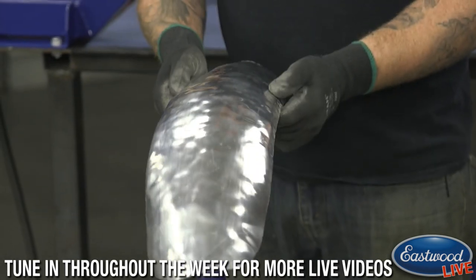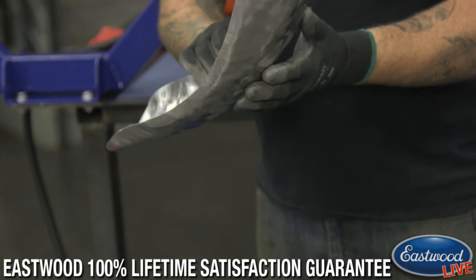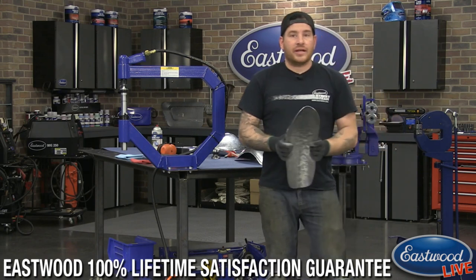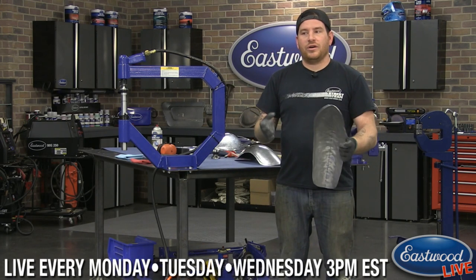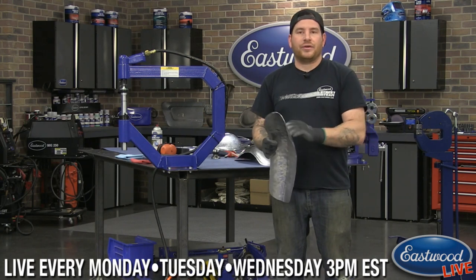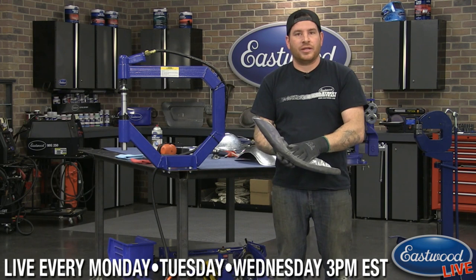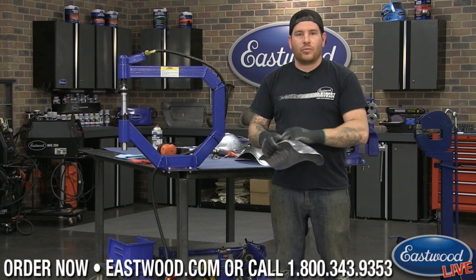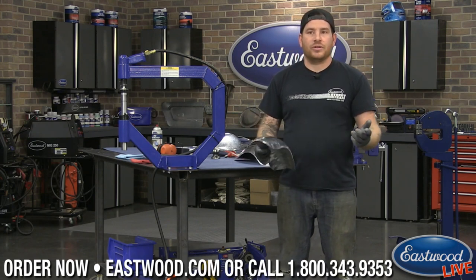So a good question we got last time is, can you do the smoothing process on the English wheel or the planishing hammer? The answer is yes, you can do it on both of those. But the problem with the English wheel is the bottom wheel needs to be sharp enough that you can actually fit it into the shape that you're smoothing. If it does not, and you try to force it, it's going to run lines into your workpiece and create a lot of work or possibly wreck the piece, which you don't want to do.